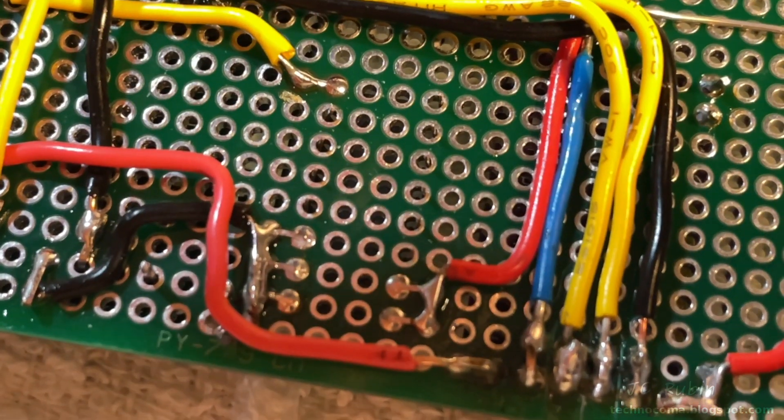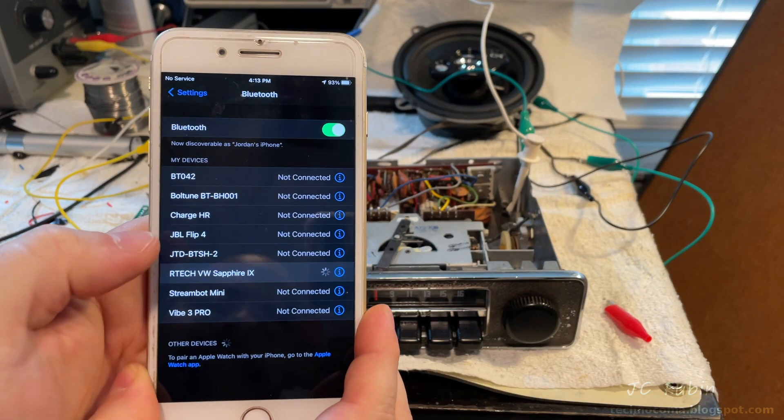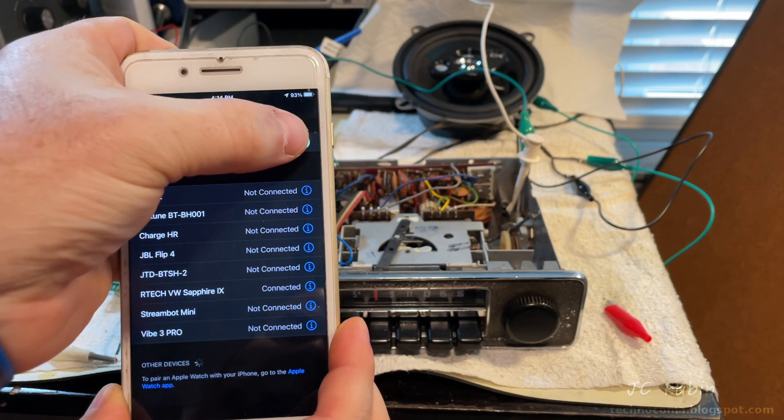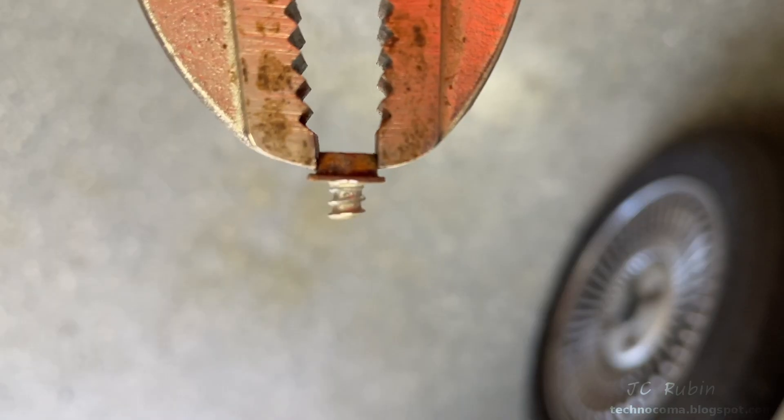I started wiring the mux — this is power and everything tied to ground — and now pin 18 wired into the three select lines. A quick check of mux switchover: Bluetooth connected, audio feeds in, and for an even longer test, Bluetooth disconnected, switching from AM and back.